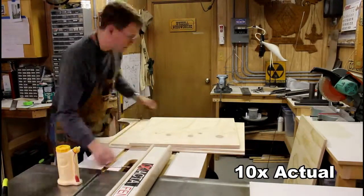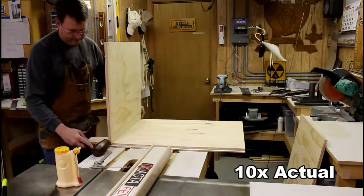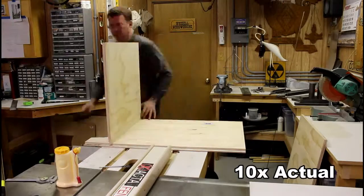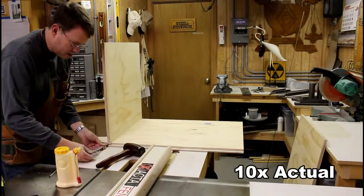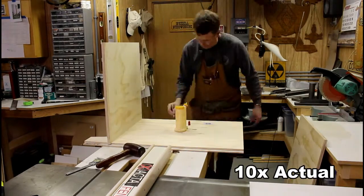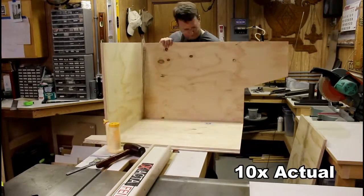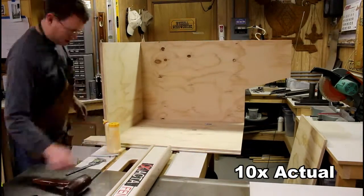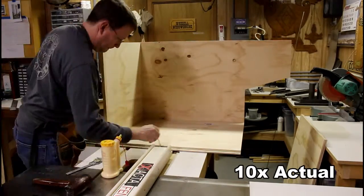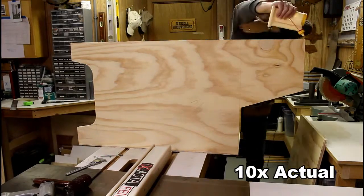So now it's glue-up time. Obviously you missed all the footage of me cutting these pieces out. Just working with three-quarter inch plywood — you can see me putting the base into the dado slot. The sides have been rabbited to allow for the three-quarter inch boards to meet with a little bit of overlap, and later on I'll take that overlap off with a flush trim router bit. Now the second and third sides are coming into place, and I'll take a brad nailer and attach them together.